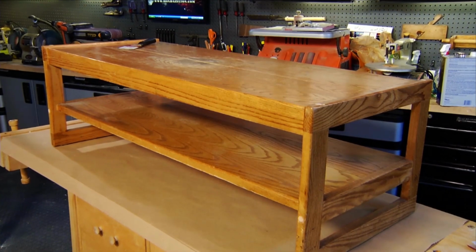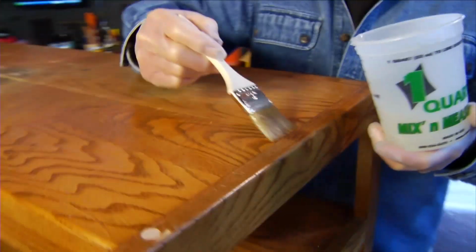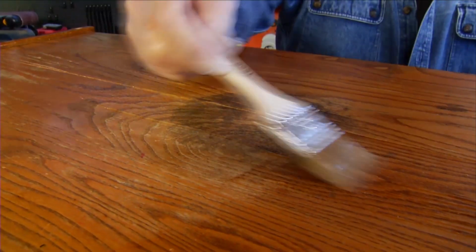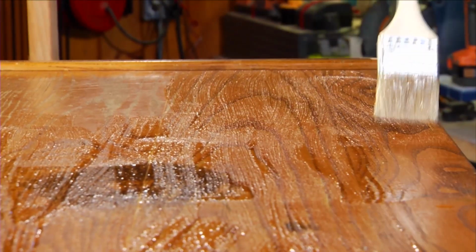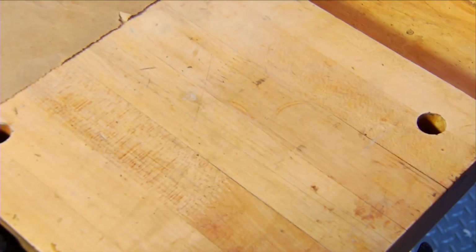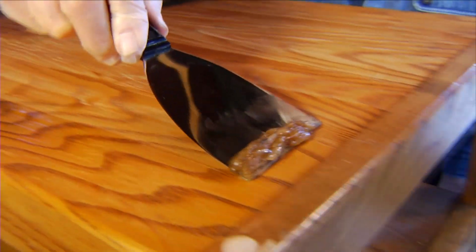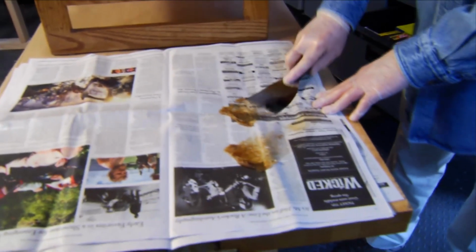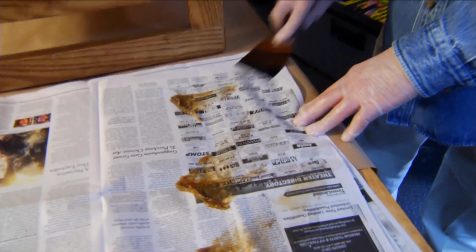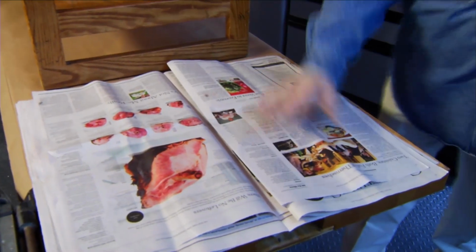When stripping wooden furniture, use a disposable brush and apply the stripper liberally with long, even strokes. Wait 3 or 4 minutes, but not long enough for the stripper to dry. The surface will begin to take on a blistery appearance. Using a wide putty knife, make long passes, moving in the direction of the grain. The old finish should lift off easily without any scraping. Wipe the putty knife on a sheet of newspaper and continue taking off the finish a strip at a time. To get a fresh cleaning surface, just turn over a new leaf of paper.